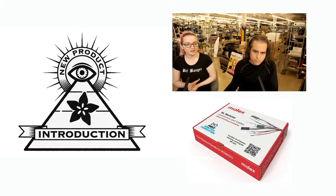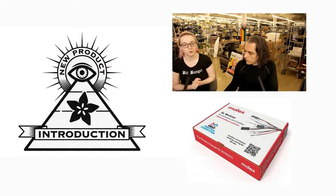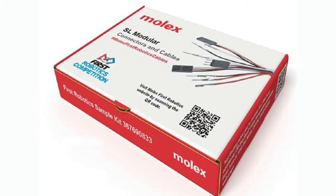So I thought this was a nice partnership and a good way for Molex to help out kids doing FIRST robotics. Okay. So this is the SL Modular Connectors and Cables Kit. It's a box that is full of like 20 different cables that are the kind of common SL modular, easy plug, 2.54 millimeter pitch, 0.1 inch pitch connectors. I'll show the cable kit, but there's sockets and plugs.